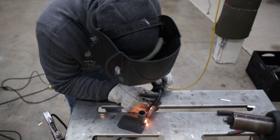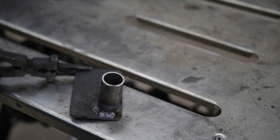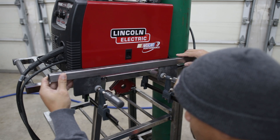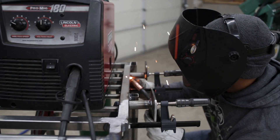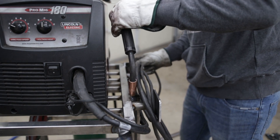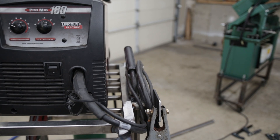As far as cable management, I never really had a good way of organizing my MIG welding cable along with my ground cable — it always just kind of wrapped around the welder or the tank. So I came up with a way to keep it all nice and organized. I used some flat bar and round tubing, placed and offset it on the side of the frame, then looped the cable around to figure out the spacing between brackets. I tacked it into place, used one of the tube holes to hold my MIG gun, and used the flat bar to clamp my grounding cable.